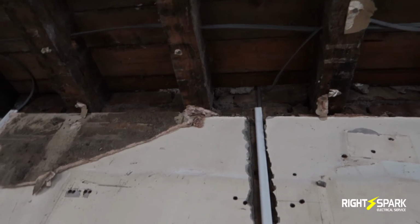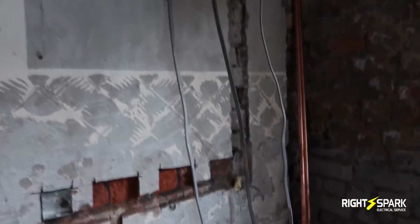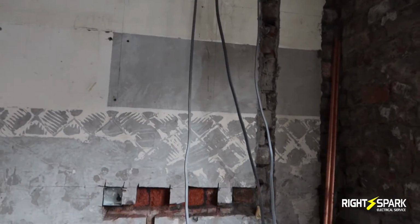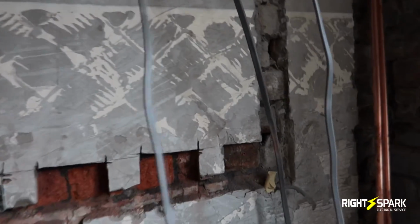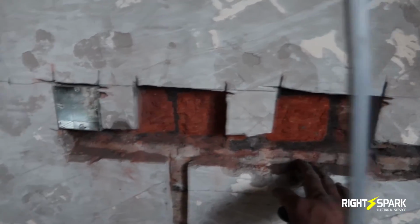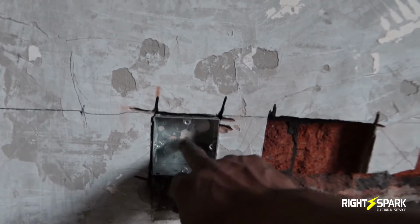There's a little landing there, so doing a double socket there, and it comes back through the ceiling, and we're going to drop it here. So it's within the wiring regulations. So also there's going to be a double socket here, and also 2 double sockets. There's going to be a cooker socket, and that's basically to feed the cooker outlet over there. And there's going to be another isolator for the extractor fan over there.